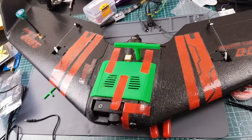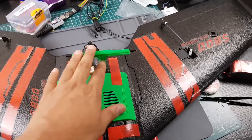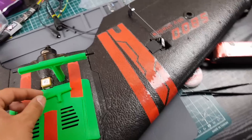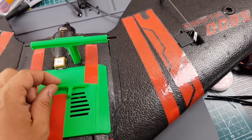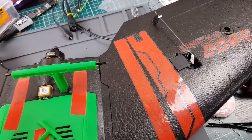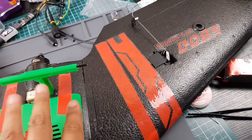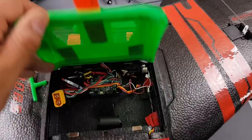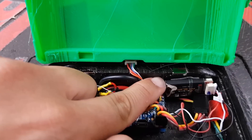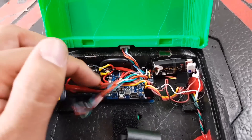Overall this build took two days, about five to six hours a day to prepare including iNav — the mixer is an absolute nightmare. I also 3D printed this antenna mount from Thingiverse. I was already using plastic tubes for the antennas, but I scaled the print to 250% and it came out really nice. I threaded the antennas through, cut the plastic piece, added a little super glue on each side — the antennas themselves are not glued. The wire is routed carefully into the R9 Slim using a knife cut so nothing rough scratches or cuts the antenna wire.